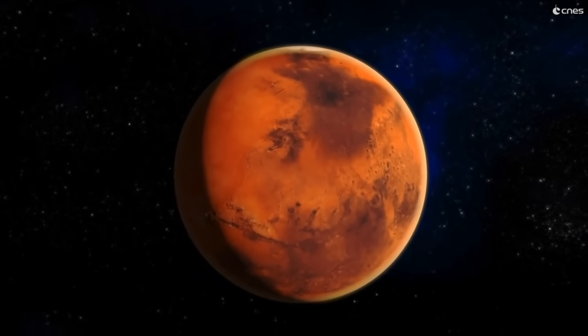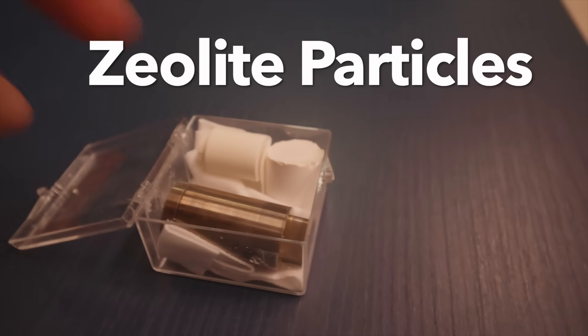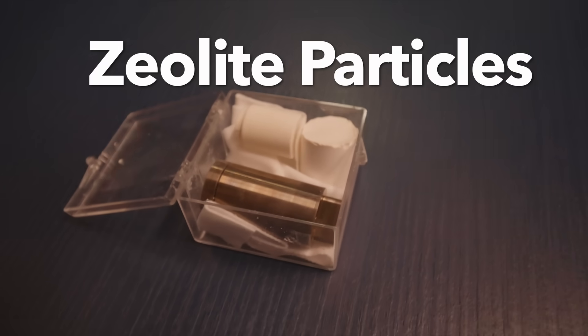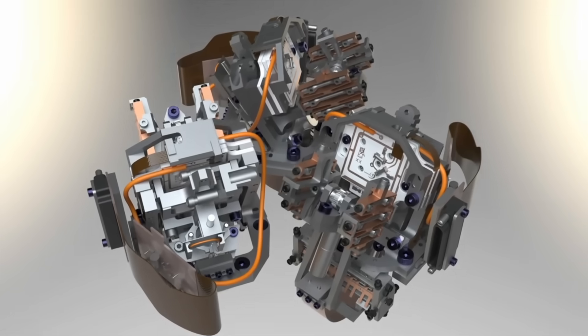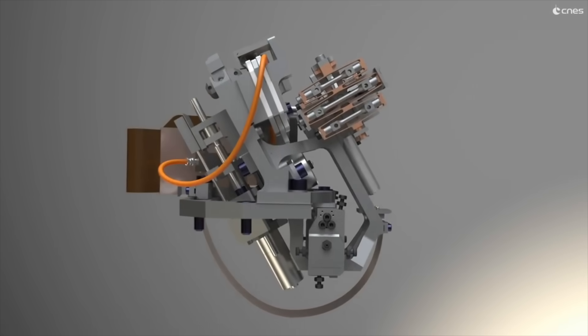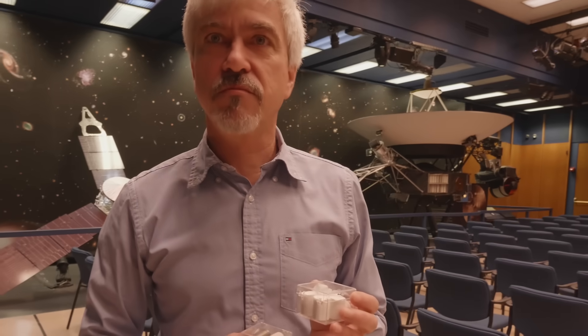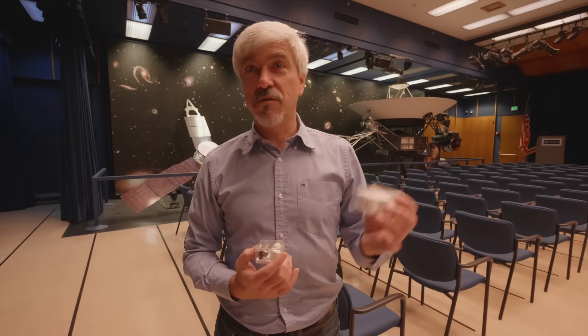Aerogel's ability to absorb is even being used right now to help detect Marsquakes. These were the ones made for the NASA InSight mission. This aerogel looks like chalk because zeolite particles are dispersed throughout it — they can absorb moisture even at very low pressures. There's a seismometer that contains three small seismometers, and since they're so small, they require an exceptional vacuum inside, otherwise the motion gets damped. The zeolites were helping absorb moisture predominantly coming off epoxies and cables outgassing. It's essentially maintaining the vacuum by pulling things out — essentially a vacuum pump that doesn't require any power, any consumption, and is very light. This is what enabled the InSight mission to work.